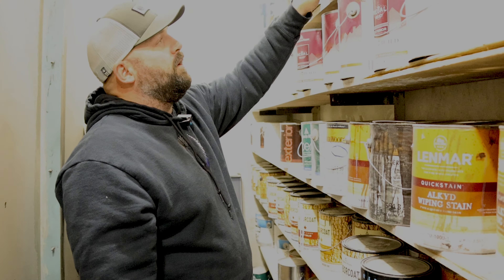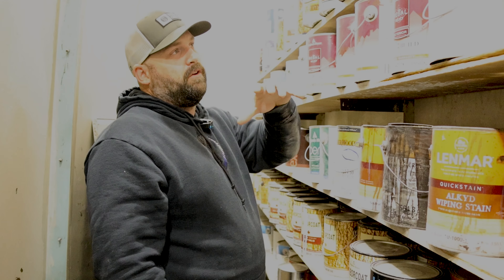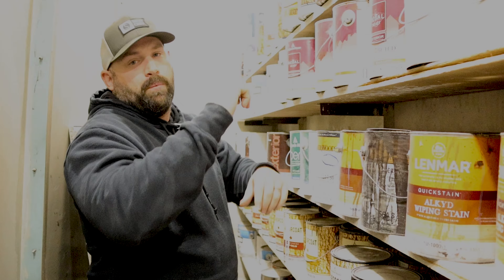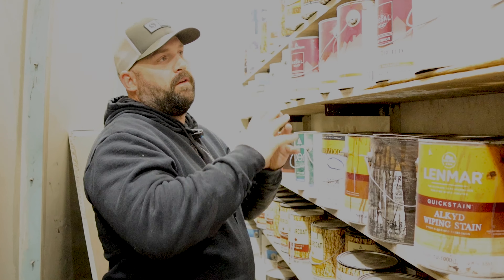Wood gets extremely thirsty, especially as it dries out. You might put something on and it might disappear and look dry again — if it looks dry again, put another coat on. You might have to put two, three, or four coats on. We've done houses where we were ready to pack up, looked back and a whole section was already dry with no shiny glistening look — just a dry spot. If you're spraying with a Wagner, don't just spray it and let it soak in because it's gonna drip off. Spray it and brush it in, then see where you're at, and spray and brush it in again.